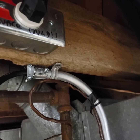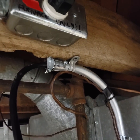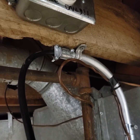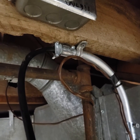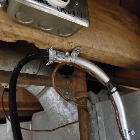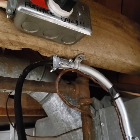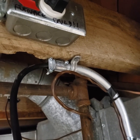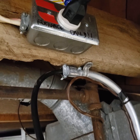So that's all that is. I talked to one of my friends who's an electrician to see what he thought about this idea right before I did it, and he said that's absolutely fine. He said it's not a code issue or anything. I read online and saw mixed information on whether you could do this, and a lot of people were asking about it. My electrician friend said basically if it's a 15 amp circuit with 14 gauge — just like this one — something like this would be absolutely fine.